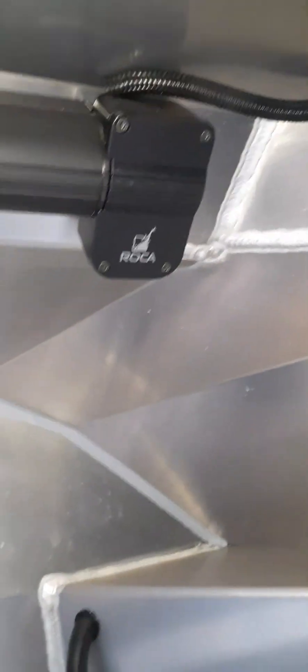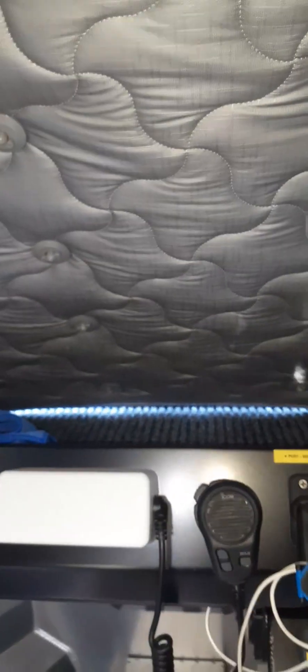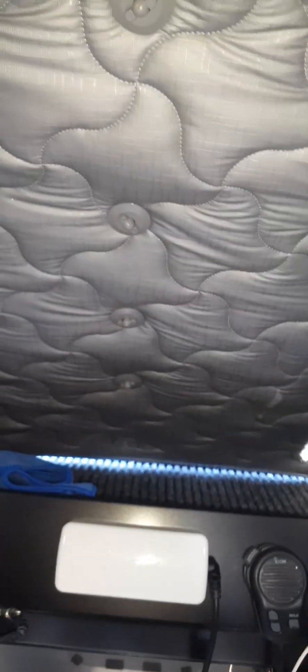Windscreen wiper motor: the old back plate, the inspection plate, cracked and has been replaced, which is good because it's quite new. The pantograph arm — if you've got a boat like this it has an arm you can slide the wiper up and down. It's got little tabs on it that come loose all the time. As it's been getting older the arms get corroded in place and it doesn't want to slide as much, so that's settled down. It was an issue though, especially with the curved windscreen.